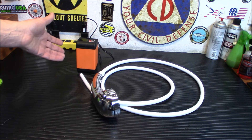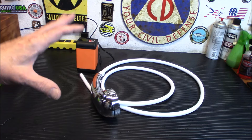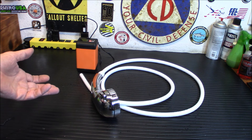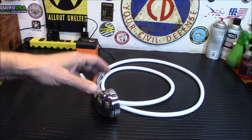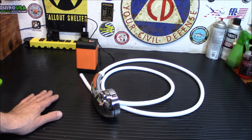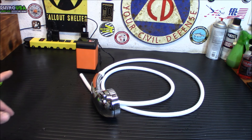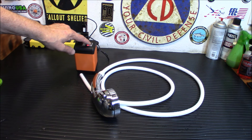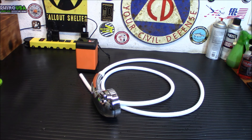There is a filter on the bottom. So if you're using water that's a little questionable, silty, or maybe a little dirty — as long as it's not really contaminated, you'll be fine. If you're taking it from a stream that has a little bit of mud in it, it's going to be just fine and won't mess up your pump at all. One thing I forgot to show you: I was running it on low out there — it goes up higher. When you push the button again it goes to medium, and then to high. So it really puts out a lot of water very quickly. It took about 30 seconds to prime and pull water all the way up — not bad at all. Some pumps take forever to prime. This one worked really well.